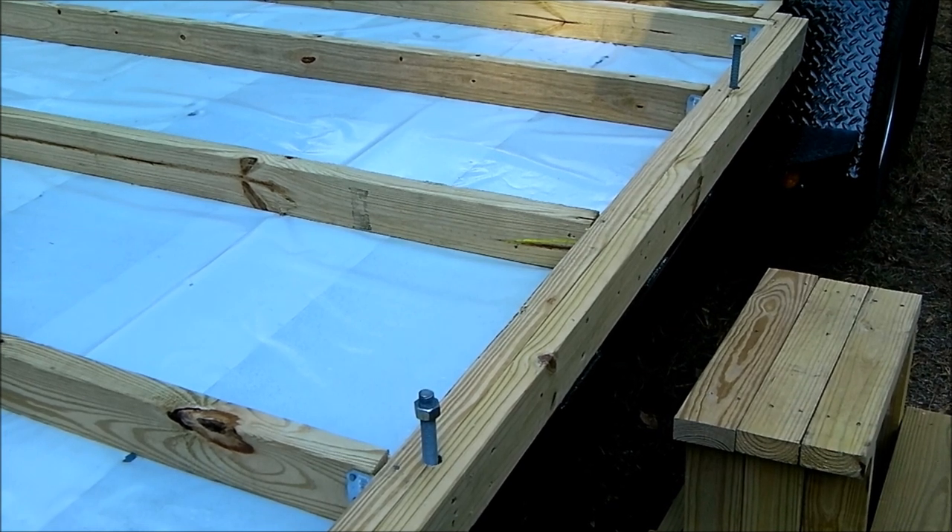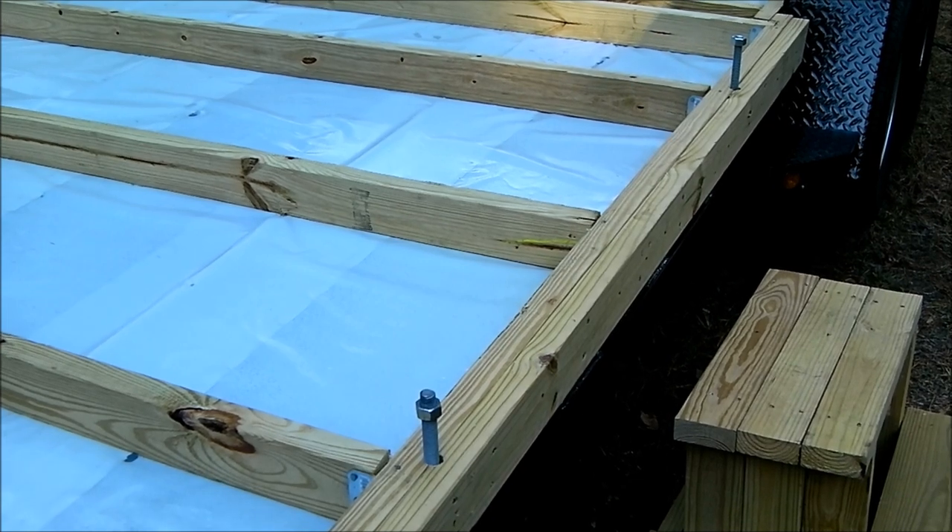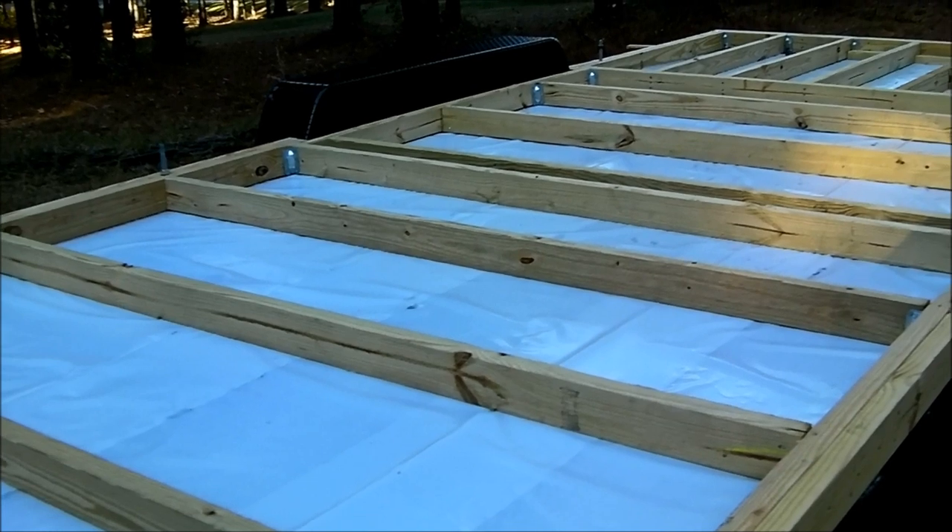Like I mentioned in my other video, I have these six five-eighths galvanized threaded rods that run down the trailer and come up through these two two-by-fours. I put liquid nail between them and fastened them very securely to basically laminate them together, so the two two-by-fours, even though they're separate pieces, are almost acting like one — a very strong piece of wood.